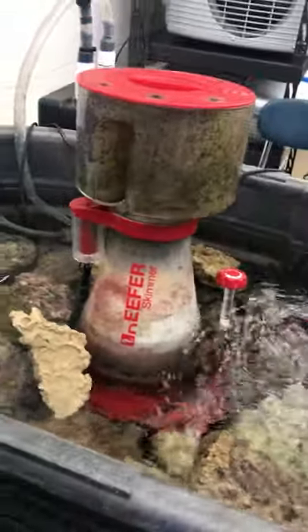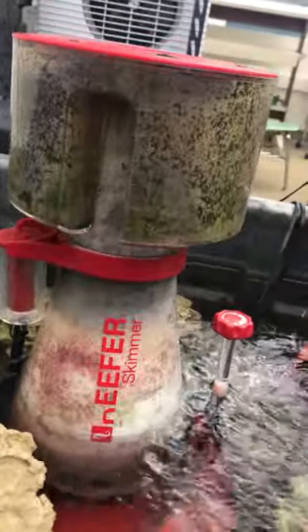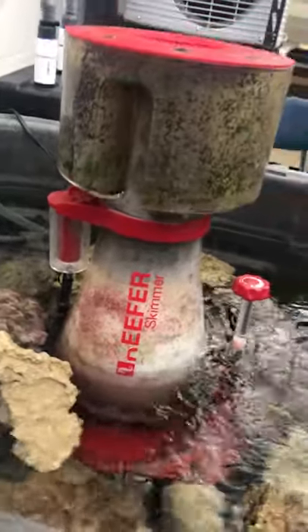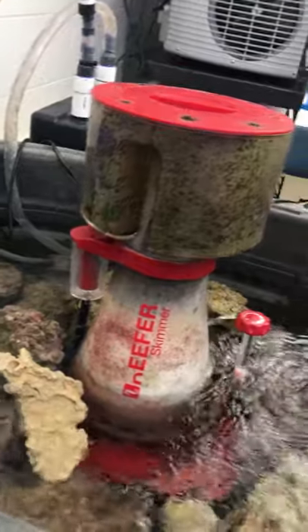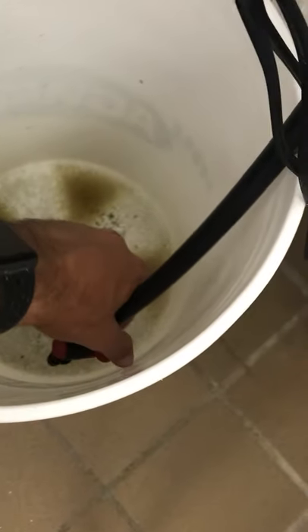This is organic waste on top of the protein skimmer — we call this the collection cup. The rest of the protein skimmer we call the cone. Organic waste travels up the bubbles and then falls into the collection cup. When you are the protein skimmer person, you control this and try to find the perfect balance of bubbles — not too much overflow but not too low either. You simply come to the other side, see this drain here flowing down into this bucket, undo the ball valve, and release the organic waste liquid to pour out in the sink.